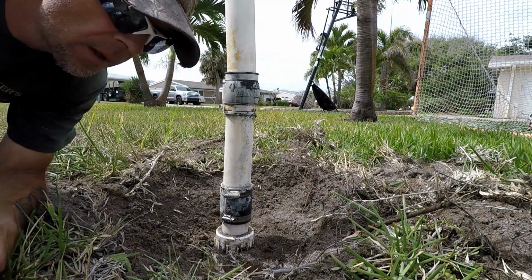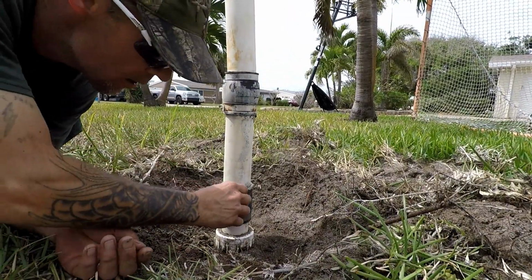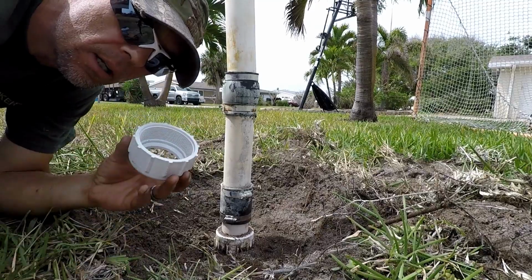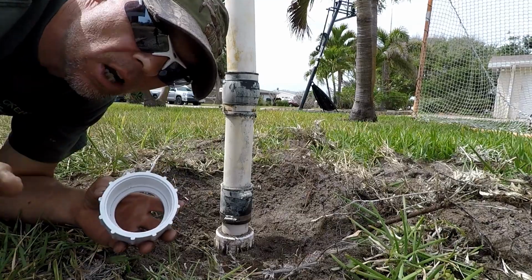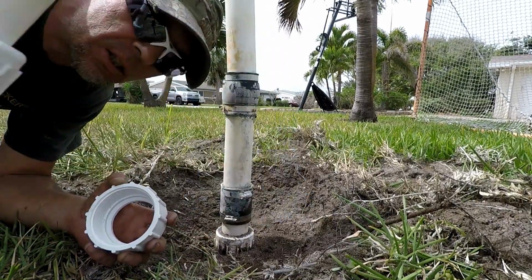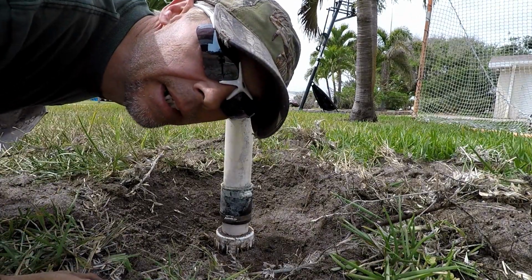Okay, so now that our glue is set up on our shutoff valve, I need to pop this wellhead off. I went ahead and already loosened up these straps that are on here, but before I do that I need to make sure I get my collar nut and rubber ferrule that goes on the bottom part of this dresser coupling and get it ready to go. So once I pop that thing off, I'm going to be sliding that down on the pipe and this right behind it, and then screwing this thing onto it. And I don't have a lot of time because water is going to be free flowing out of this well, and I don't care to get soaking wet. Okay, here we go.